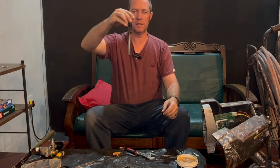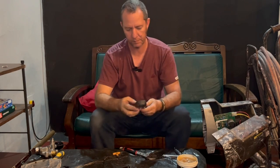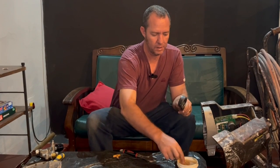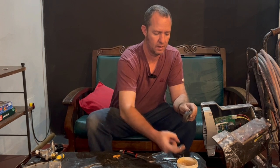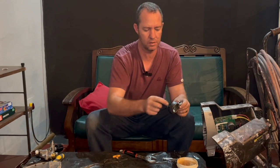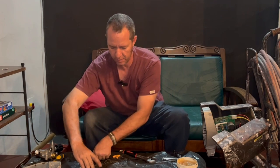And it looks like that. Okay, so now the piston is on that connector rod, you can call that. We're going to give it an ample amount of decent quality grease everywhere and pack it nicely in, because we've cleaned all the old grease out, so it doesn't run dry and it's nice and lubricated. So that's ready to go.